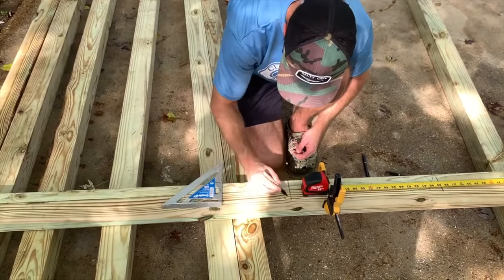So what I did, again, is I put a bunch of that asphaltic coating down, I took the shingle, I installed it in place, and then I nailed it as far up towards the front of the shed as I possibly could, while still contacting the wooden fascia board. Then, as you can see, I'm taking some of that asphaltic coating and I'm putting it over the nail heads and spreading it out with my finger, just as an additional layer of water protection.